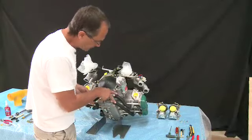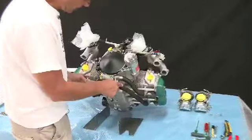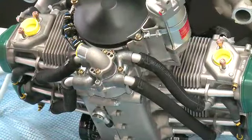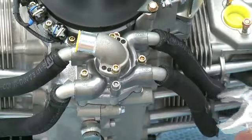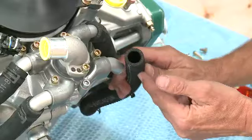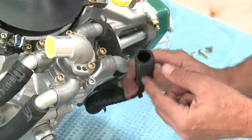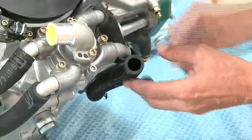Right, next thing to do, we remove these 4 coolant hoses over here from these fittings with these clamps, and move them out of the way so we can get the engine suspension frame on. There might be a little bit of coolant in the hoses still from the test running at the factory, so best is to not let the hoses lie down, leave them standing up.